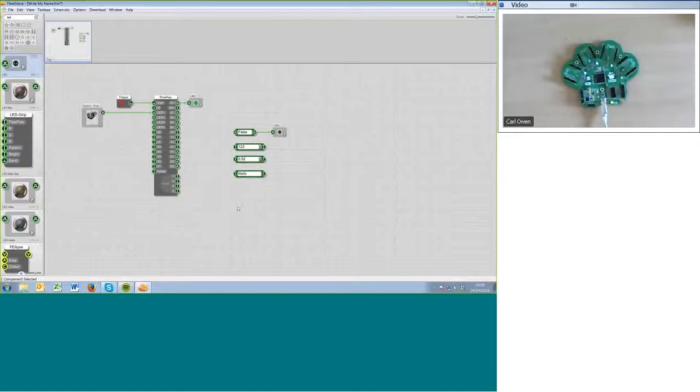Okay. And inside FlowStone, we can connect various ones of these together and do automatic type conversion. So if I have an integer here and connect it to a float, if I put 10 in there, you'll see it's 10 in the float. And if I then connect that to a string, it's also converted instantly to a string. So if I reorder these like this to illustrate the difference between floats and integers, if I put 10.5 in there, you'll see that the integer rounds it off to the whole number. So I'm going to be using a lot of these.